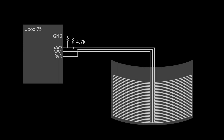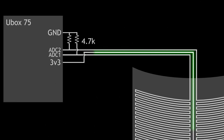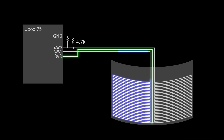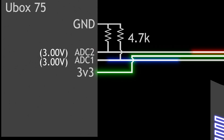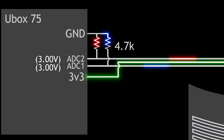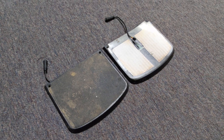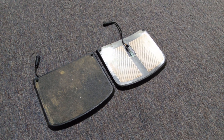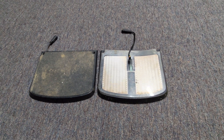Here's the wiring diagram. You can see that we apply the 3V3 pin to the center tap of the footpads. When the sensor is activated, it bridges the center tap to either side of the output pins. These then hit the ADC ports and they register a voltage increase. After the pads are depressed, the remaining charge is dumped through the pull-down resistors and the ADC should result in a voltage of 0. Some pads are more leaky than others, and water ingress can cause these values to rise as well — this is the case in stock OneWheels too.